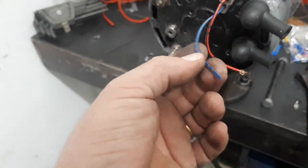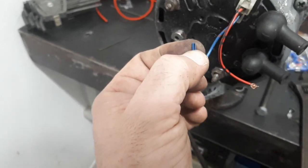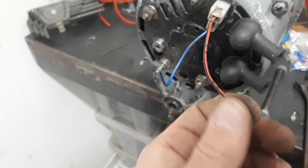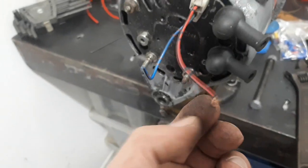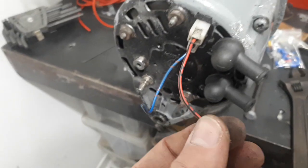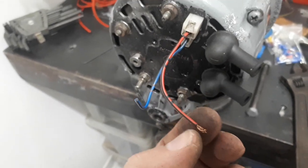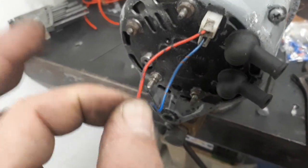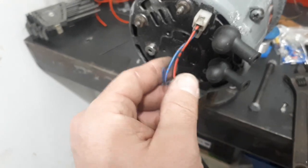The blue with a white stripe is the warning light terminal — wire this to the negative side of the warning light, with the positive side of the light going to the key-on positive. This is the sense terminal — this alternator has an external sense, so if you wire a series of diodes to isolate your service and engine batteries, you can connect this to the engine battery and get the voltage from the real battery, not from across the diode. Connect this to positive if you want the alternator working. If you liked it, give it a thumbs up and subscribe for more.